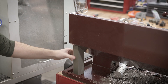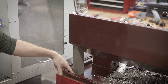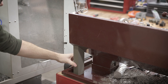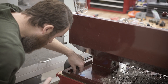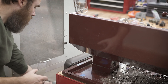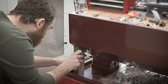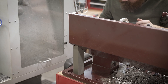This little foot actually worked a lot better than I thought - this is really sturdy now. I am going to add a little piece of double stick tape underneath because this can still lift up, and as I'm pulling off the tool holders I don't want this to wobble around. I'm using some double-sided carpet tape on the bottom side of the foot, scuffing up the surface a little bit, adhering it, and putting it all back together. For screws I'm using number eight sheet metal screws threaded directly into the plastic - I just use the dimensions in SolidWorks for a number eight tap to get the right dimensions.